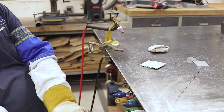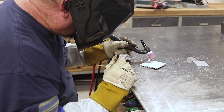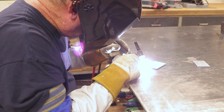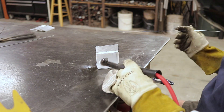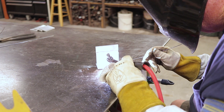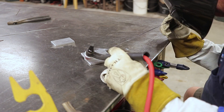Here's the 1/8-inch aluminum with the helium-argon mix, and right out of the gate it just forms a puddle and you're going — that's what's really cool. The lap joint turned out really good, and on the T-joint it just fired right in there, nice and smooth. That was really slick; I really like the way that works.